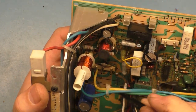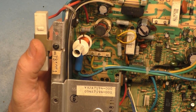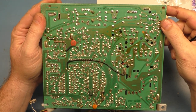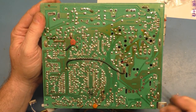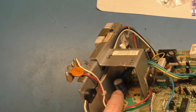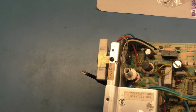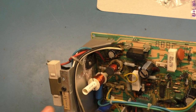C38 is missing. C69 and C36 are missing. The two safety caps in there. What else? I think that might be it, looking at this thing. Someone has removed R92, and obviously the flyback's gone as well. R91 resides right in there. R92 is right here. R91 is deep inside there next to the C40. Yeah, C40. So someone has removed R91, the flyback, C36, C69, C38.